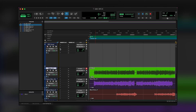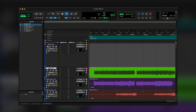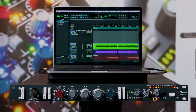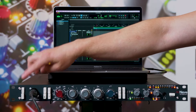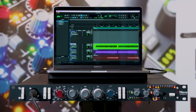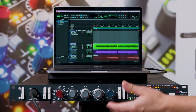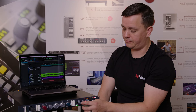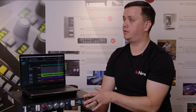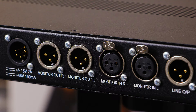Once your I/O is configured, go to the channel you want to track or overdub on, set the input to Neve Input 1, and set the monitor path to stereo monitor output one and two. Connect a microphone to the front, press the front button to select the front input, adjust the gain, and optionally add 1073 inductor EQ. The output level acts like a channel fader and runs in parallel between the analog output and the digital output, so you can split the recording into two systems simultaneously.